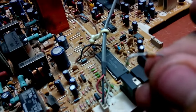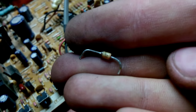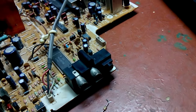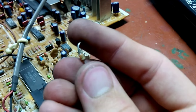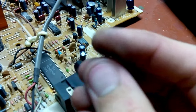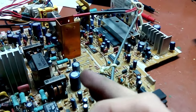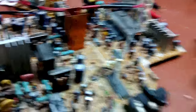The diode has a marking that says 56 — I think it's the voltage. After some research, yeah, it's basically a 56 volt 1 watt zener diode sitting on the 42 volt rail of this chassis. It's there to protect from over-voltages, because in operating mode the voltage is 42 volts but in standby it can raise up to 50 volts.